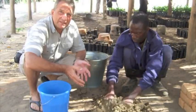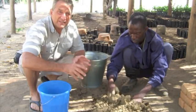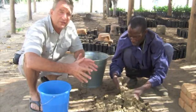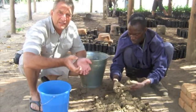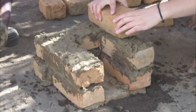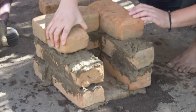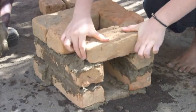What we're doing here is mixing some water and mud from a termite mound. This mud is ideal — it's what they use to make local bricks, like the bricks on the stove here. We're going to use this like cement to bond the bricks together, and then put a coating about one to one and a half centimeters in thickness all over the stove. We put a full brick on one side, a full brick in the back, going over the joints — a half brick in the middle, and our final brick across the front.